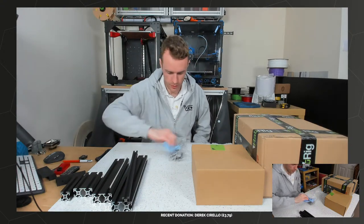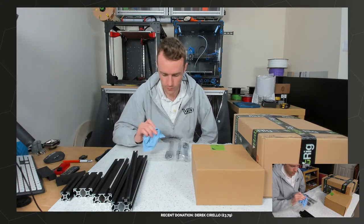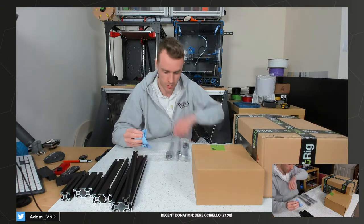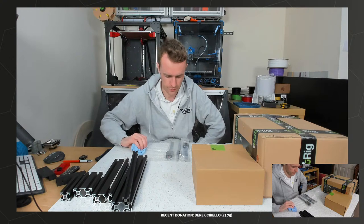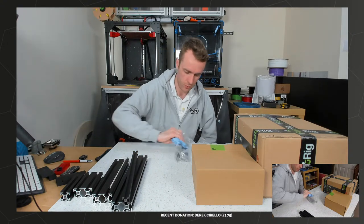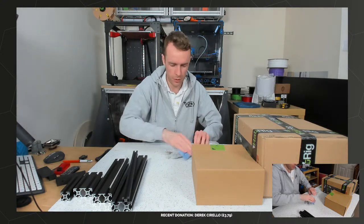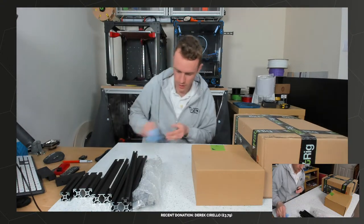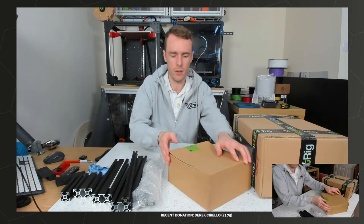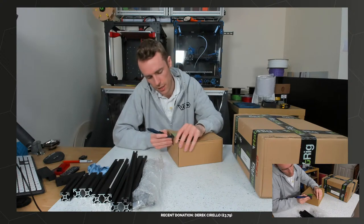Since these linear rails are high carbon steel and covered with quite thick lubrication, I would probably recommend stripping them down carefully and replacing the thicker oil with something more greasy - more of a purpose-specific, application-specific lubricant. Technically they'll probably work fine as is, since an oil is still an oil, but you're probably better off opening them up and lubricating them with something more appropriate.